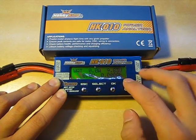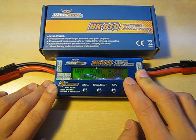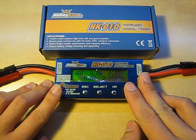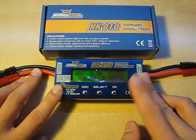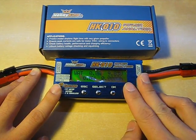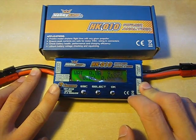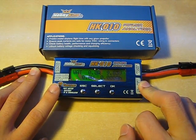I've tested it with a Tektronix benchtop multimeter, as well as a custom current meter that I've built myself. Compared to other power meters like the Watts Up — a bog-standard power meter for RC hobbyists and other DC power users — it holds its own ground. If you want a higher current range, like up to 130 amps, you might want to invest in something a little more expensive. This is only $20, but it goes up to 100 amps, which is good for most small RC applications.